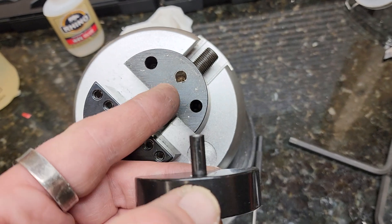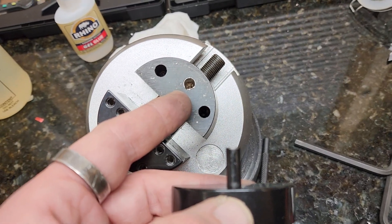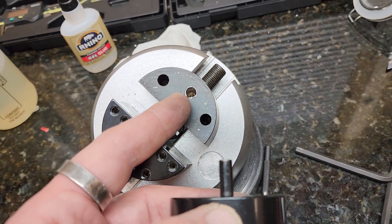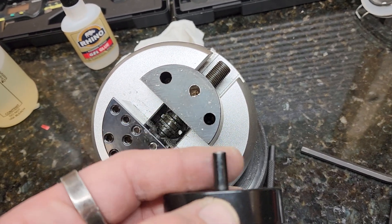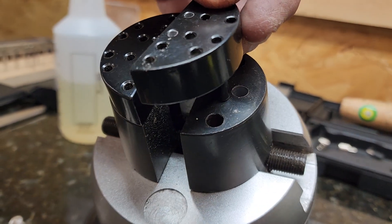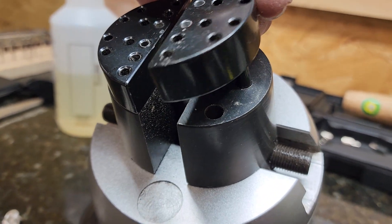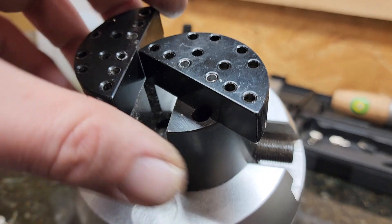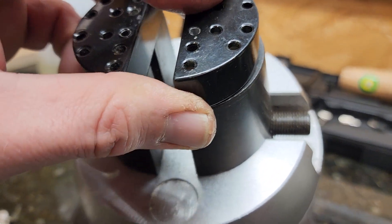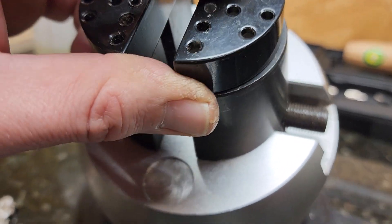What's crazy about that — as you can see here, I made shims from a cheap soda can. Soda can shims are one tenth of a millimeter per side, which gives two tenths total, which leaves one tenth of a millimeter, making for an absolute ideal fit. It's hard to do on the phone, but if it's in there, it's just perfectly perfect with zero — I mean zero — play.